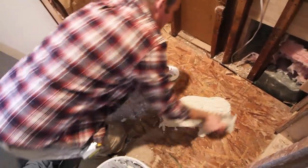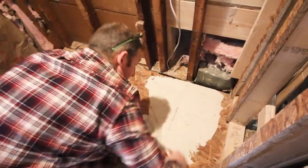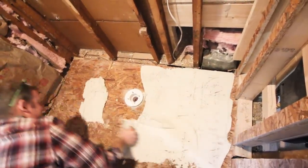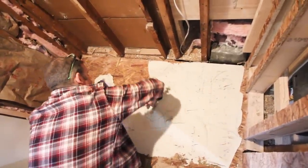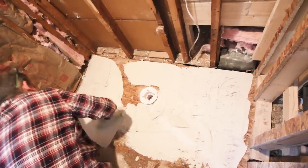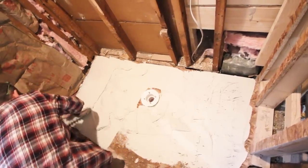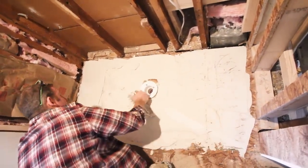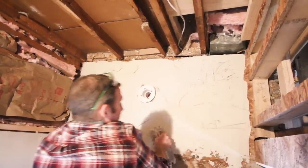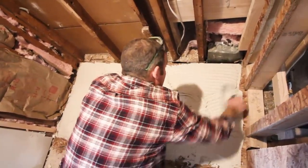You want to use a modified thin set to apply this with. Burn it into the substrate with the flat side of the trowel first. In this example, we used Ardex X5 modified thin set. This is perhaps the most important step for the installation of the shower slope pan. So we're going to show you step by step how much thin set is required for the installation.